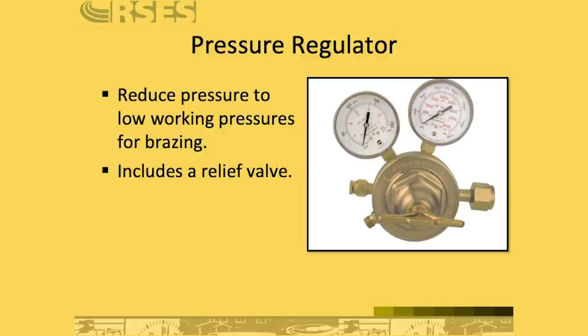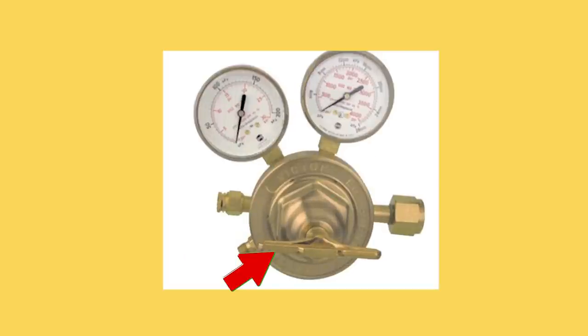Whenever you're working with high pressures, you want to make sure you appropriately use a pressure regulator. I see technicians do this all the time, where they'll take a pressure regulator, the dials will be knocked off of it, the thing will be damaged, and they'll keep using it. That's really unwise. When you're using a pressure regulator, you turn that T-handle outward, so you turn it counterclockwise until it's loose every time, and then you dial it in to the proper outlet pressure. That way you're safely, slowly increasing the pressure on your manifold. I see a lot of technicians try to dial it in at their gauges, and that's just not the design of those manifolds. Use your pressure regulator wisely.